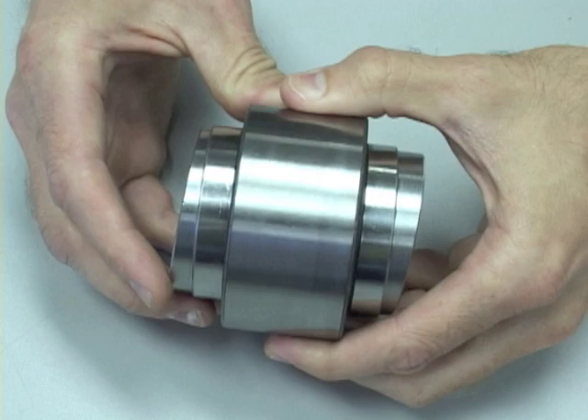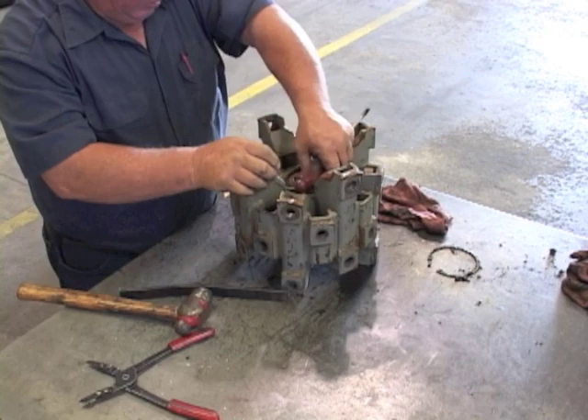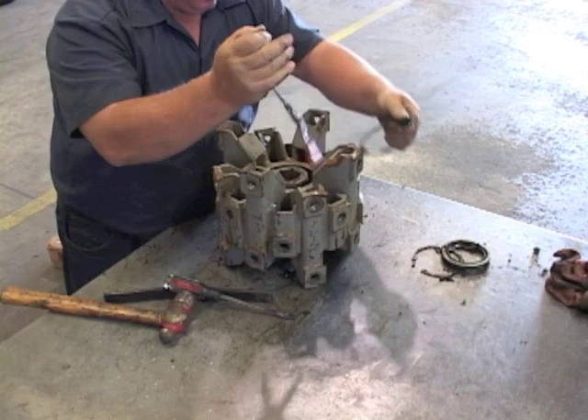Removing the rotors unnecessarily can contaminate the rotor bearing and reduce its functional life. It is recommended that any rotor removed from the shaft during repair have their bearing adapter assemblies replaced. With the rotor free from the shaft, remove the seals and snap rings. Snap rings may be reused if not destroyed, while the seals must be replaced.